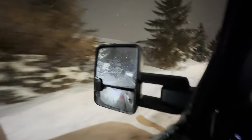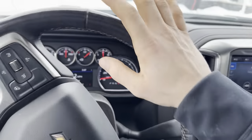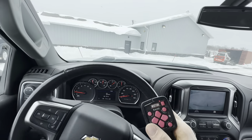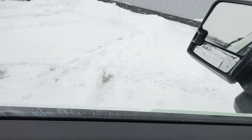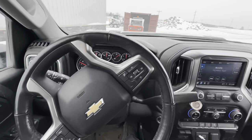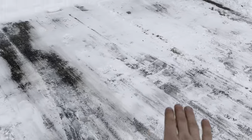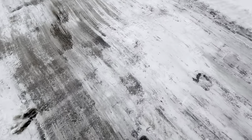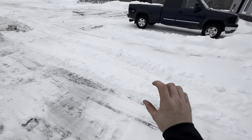Just for kicks let's see what back drags better — Western 8'6" V-plow or Cat D3. Two passes — see the pretty good smear, nowhere near the ground, like two to three inches up. Now let's see how the old D3 does. Going forward this will cut right in. Yeah there is a difference — a lot closer to pavement, still a pretty good smear going forward. V-plow back drag: not very good. With the D3 you can see all the blacktop — probably within 1/16th of an inch. Right here is about nothing. Here it's about an eighth versus that's probably like two inches.